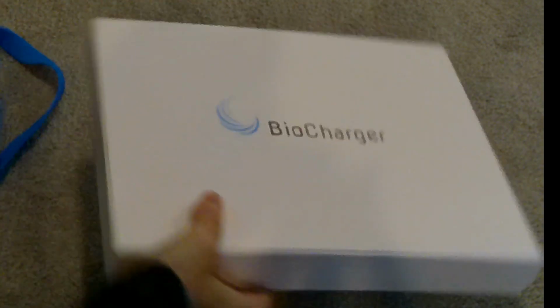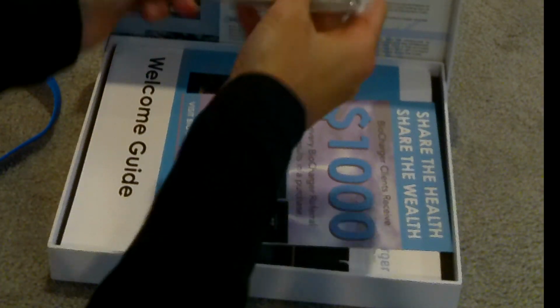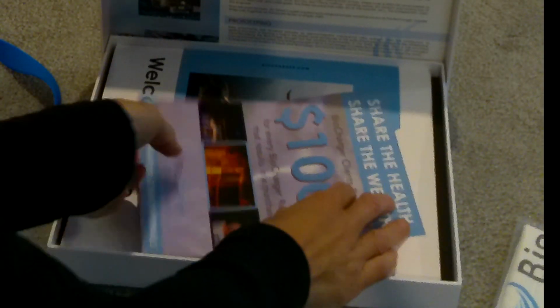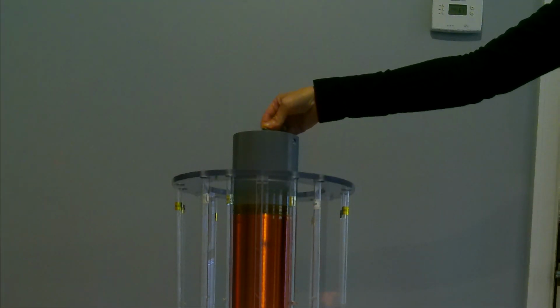We will now need to get the small white box that came inside the box with the base. You will notice a microfiber cloth. If you need to now, go ahead and dust off anything that was left behind from the foam while it was packaged. Now we are going to need the two flat washers, split/lock washer and the coupling nut right now. Take one of the flat washers and place it on the bolt on top of the secondary coil.